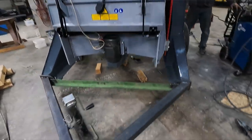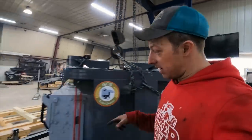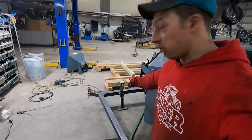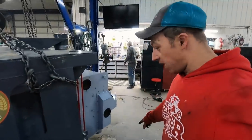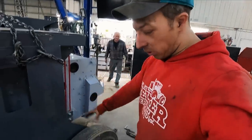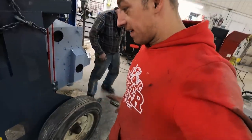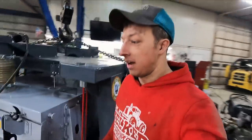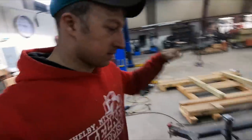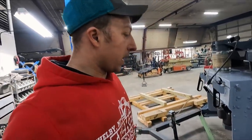And then when you get in a position where you're ready to clean, you get a high lift jack, or I might, like he was saying, add some more little pipe stubs for a trailer jack and put that on the ends. Then you jack up a corner, pull the wheel off, put a railroad tie or whatever blocks we make, some type of stand, slide it underneath, let it down, and do that on all the corners. And then the unit will be nice and level, hopefully, on the ground. You can use shims and stuff to level it. And that way it's portable.